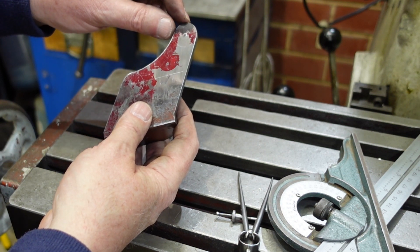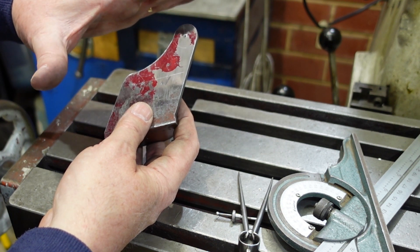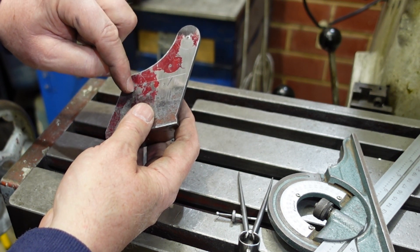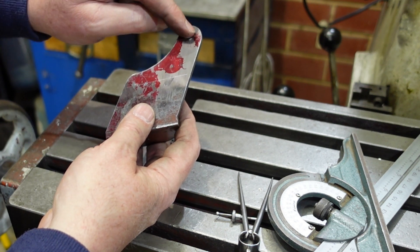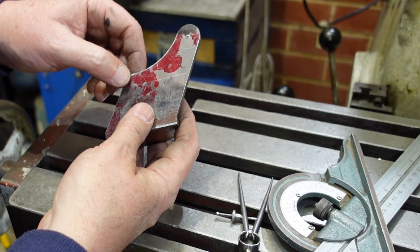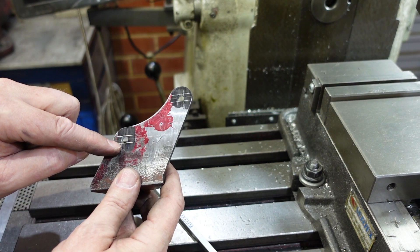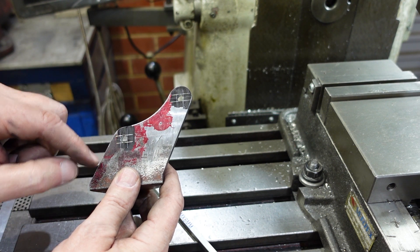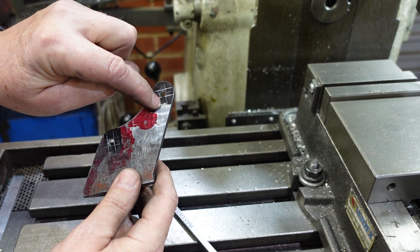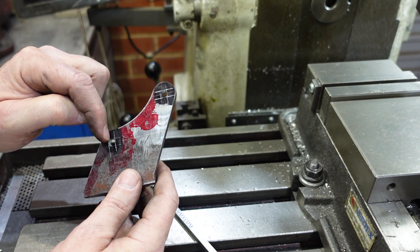The bolt sides don't have to be exactly vertical - if they're not quite vertical it'll just pivot a little, and that's okay. If the center distance is slightly off it just means the banjo sitting on top will be slightly off. You still have two holes to locate, so don't get too fussed about accuracy - it's nice if you can do it precisely, but if a hole is slightly off it's not the end of the world. For marking out where the square holes need to be, you can come off the bottom with a square and pick up the center of those 6 millimeter holes, or use a height gauge to scribe the marks at hole center plus or minus 3 millimeters.